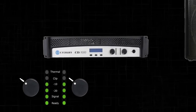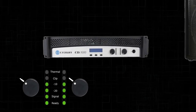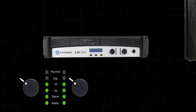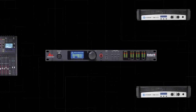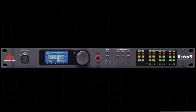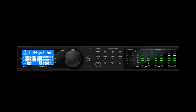Adjust your amplifier's attenuators until you reach the desired performance level and have a good blend of highs, mids, and lows. You want it to be as seamless and flat as possible. Remember, you cannot raise the attenuators past the mark that you made, so you'll have to pull the louder frequencies down. For example, if there's not enough bass, lower the mid-high amp attenuators. If you cannot reach the desired amount of gain, your system may not be adequate for the size of the venue. Once you've completed this procedure, you can run the auto EQ.